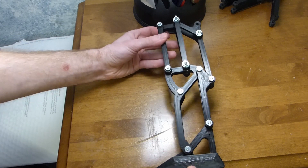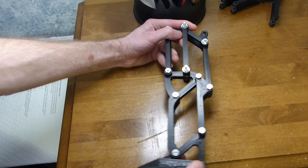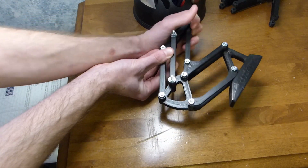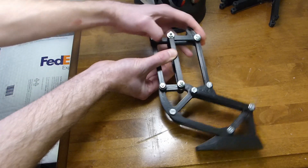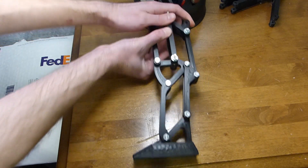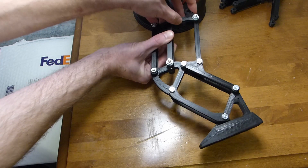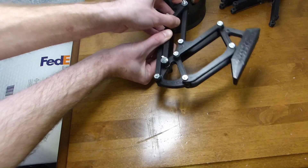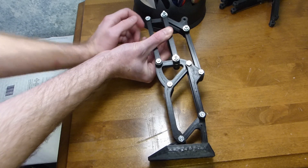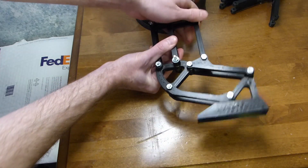It's basically the same design, except it has an expanded, altered knee section that allows for a wider swing range — completely up like this even, without turning the thigh piece. You get to a certain angle and you need to bring the foot angle out in order to bring it up further. But it's fine to need the foot angle to be altered, because that actually matches what a human leg would need to do — independently controllable foot angle and lower leg angle.